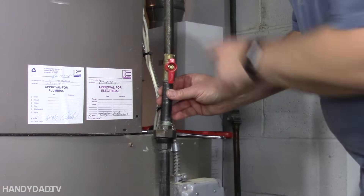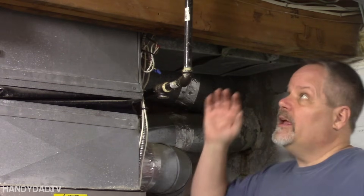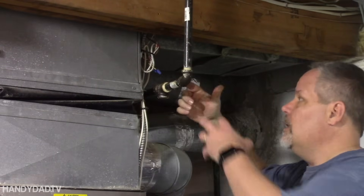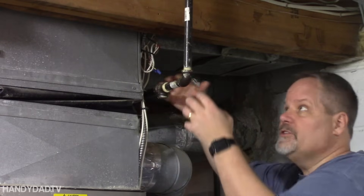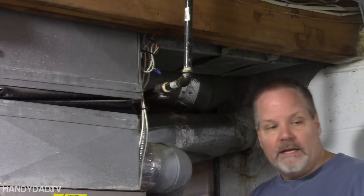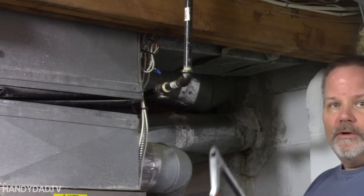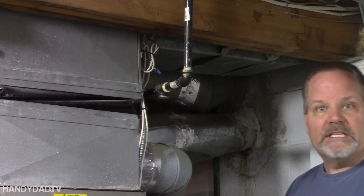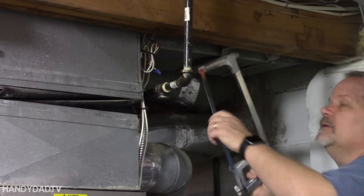This I'm going to reuse — I'm just going to connect CSST pipe here. Unfortunately, I failed to add a union up here where this goes to the stove, so I'm left with a situation where I can't loosen the rest of the pipes. I actually have to cut the pipe. Now, you can cut a pipe with gas in it — it is not going to explode. But use a hacksaw, not a sawzall. A sawzall vibrates the heck out of everything and is more likely to start causing leaks.